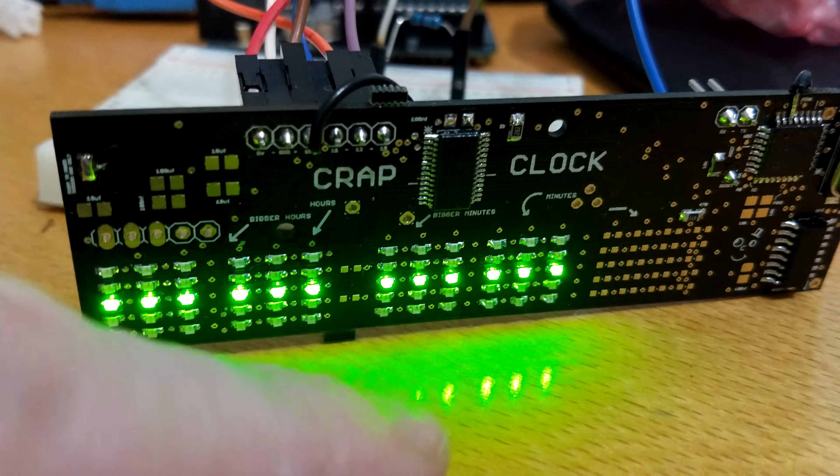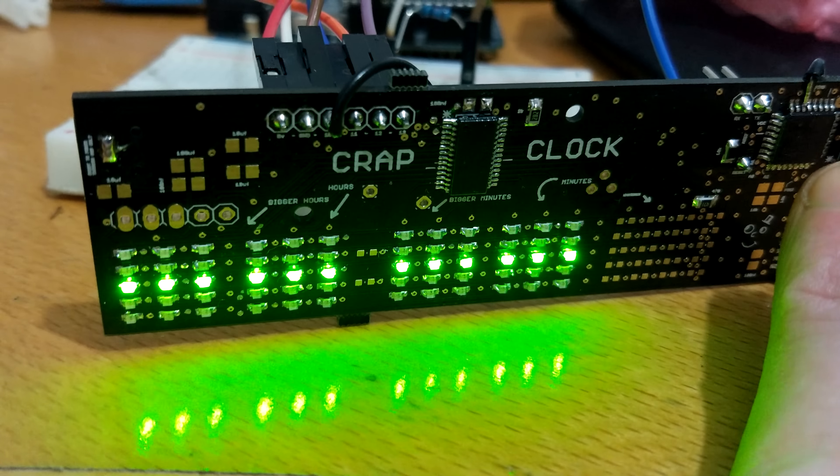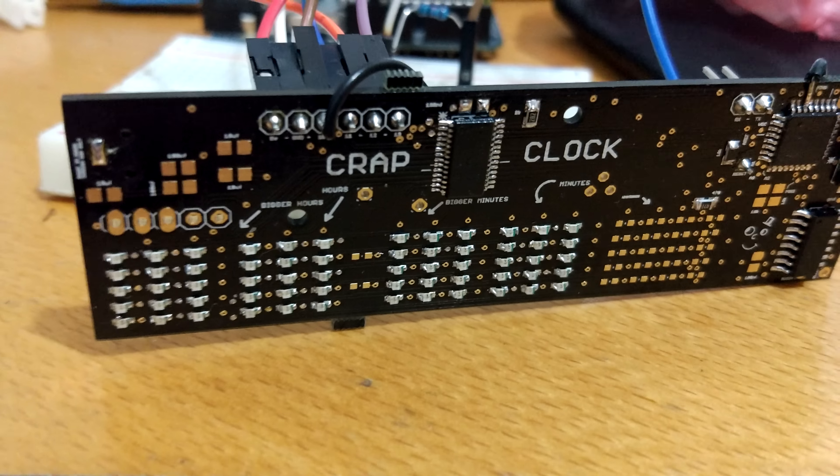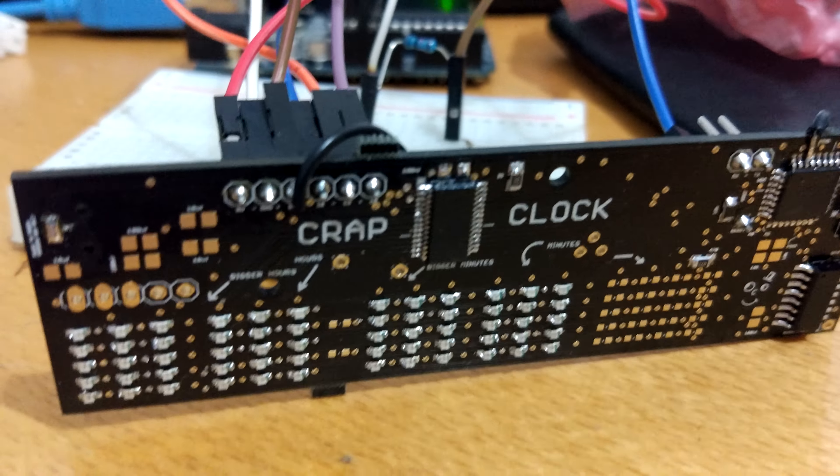which is connected to the blank pin on the TLC5940, but it isn't connected on the chip up there. But it is now with a bodge wire, and I'm going to correct it in the schematic.